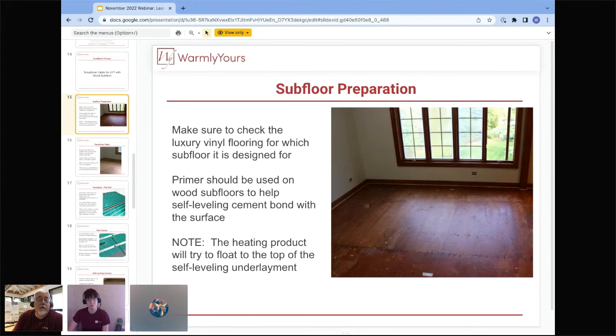There's an important difference between self-leveling being dry and being cured. If you use fast-setting SLC, it may be solid in four hours, but it's not fully cured for another seven, fourteen, or twenty-eight days — check the bag. Don't turn on the floor heat until the SLC is cured, not just dry. You can install LVT over the SLC once it reaches a certain moisture percentage, but you may need to wait overnight or a day or two depending on humidity.